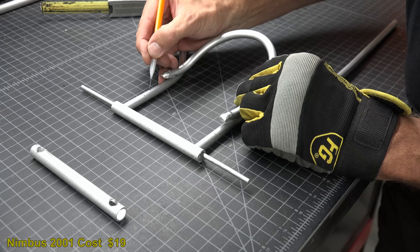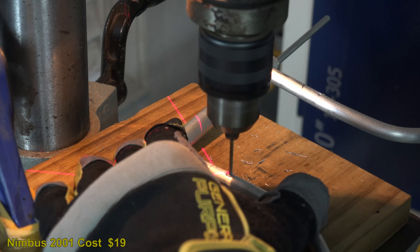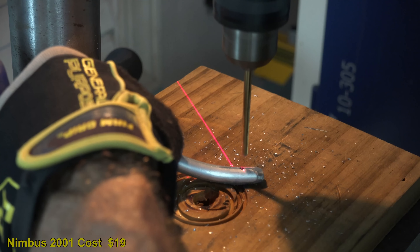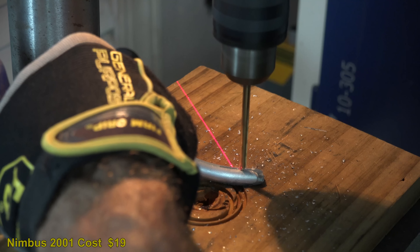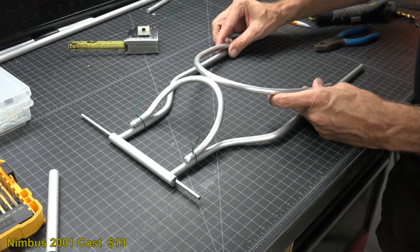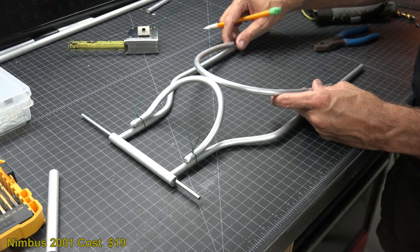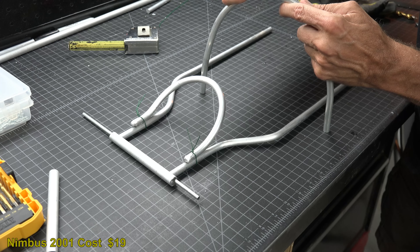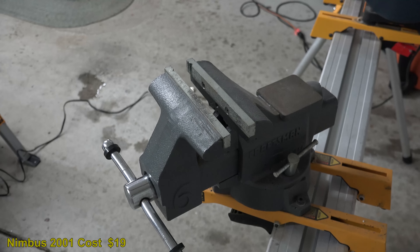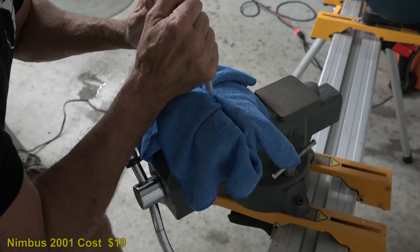Here I use a mechanical pencil so I can extend the lead out and pass it through the holes I just drilled and mark the lower legs. Then I simply drill the pilot holes where the marks are. Notice that I only drill halfway into the rod. I then take a drill bit to widen the holes at the top to allow the heads of the screws to countersink and be closer to flat once installed. I tie down the upper arc because once I place my screws in it, I don't want to take them out again — I think that weakens their hold. I still need to drill the center hole that joins the two arcs together, so that's why I did not attach them yet. I am just eyeballing this but where the arcs touch is where I place my marks. Both arcs need to be marked.